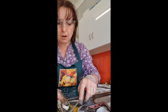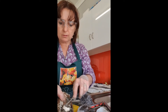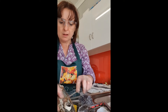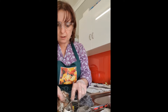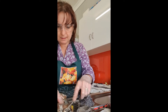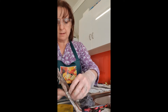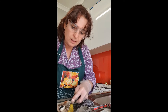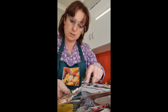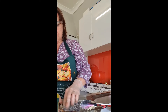I don't really want to be scraping the surface but it's really thick here with paint, so I just want to see if I can pick up a corner just to break the seal of it. It's very difficult when you've got gloves on, but you need gloves because I don't know what this paint is — I'm assuming it would be lead-based. Keep it a bit wet.